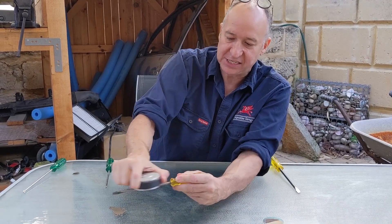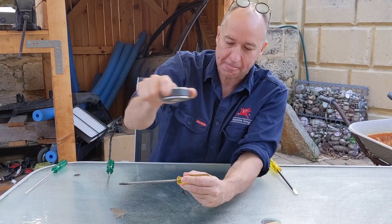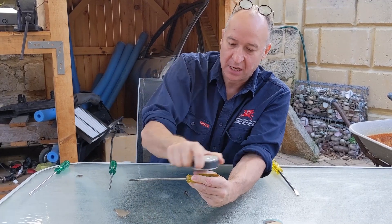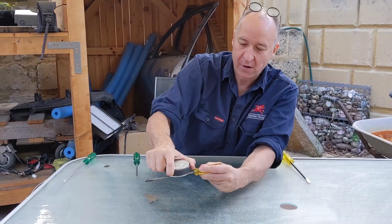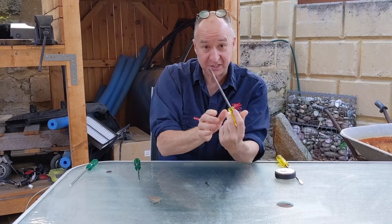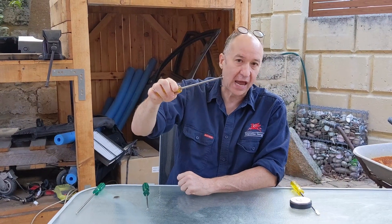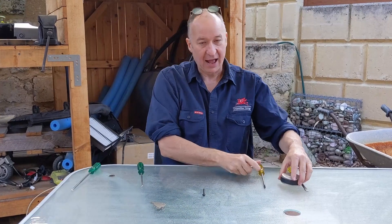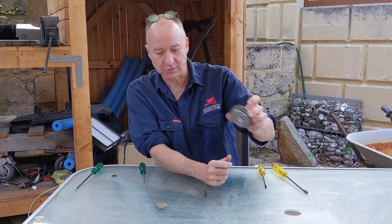You need to do that 10 to 15 times. I'll do it another four times — one, two, three, four. Check this out: it's now magnetic. You've now induced magnetism within this screwdriver, and that was with just a magnet pulled out of the back of a household stereo speaker.